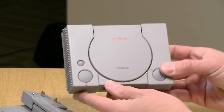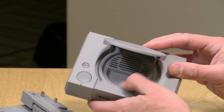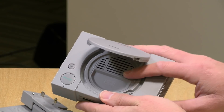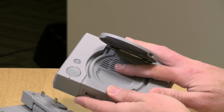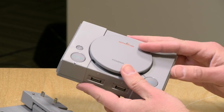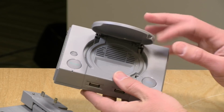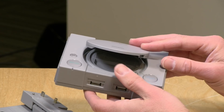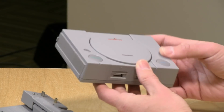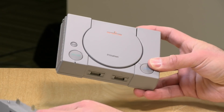You have some functional buttons on the front. The one on the far right will open up the lid, and you can store your SD cards in there if you want. There are also some vents for the CPU of the Raspberry Pi, and that CPU sits just underneath the vents. This case does not come with a fan — some of their other ones do. There is room for a fan in here, and I do recommend getting a heatsink or something for your Pi CPU, because when this is closed it will contain the airflow a bit. It would have been nice to see a fan included, especially with the premium price of the display version.